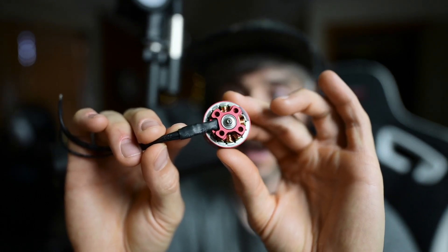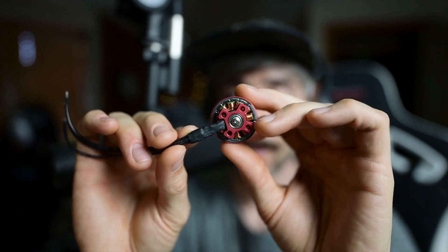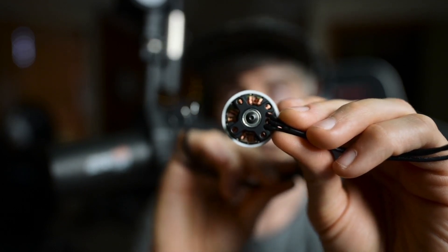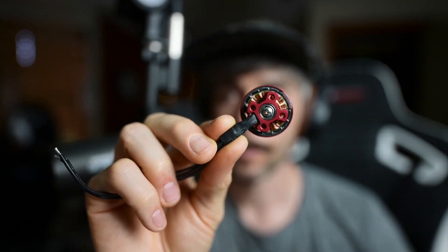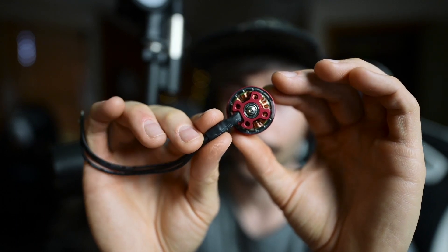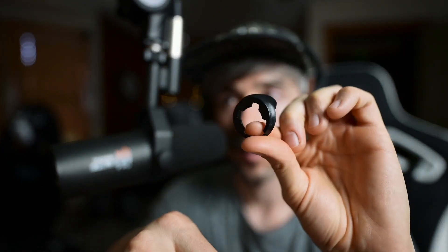Beyond the bell design, there's also a stator design change — still 2306, my favorite stator size. The screw is now plated steel instead of the bare raw metal on the V3. The base is now 16x16 mounting holes, which was a change from the V3's 19x19. Some frames only offered 16x16, and there was no added benefit to 19x19, so I changed it for weight savings despite some initial reluctance.